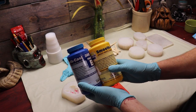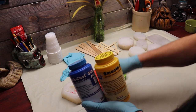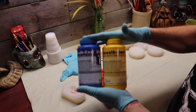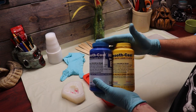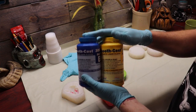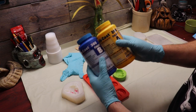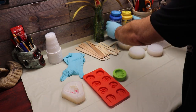I went to Amazon and we're going to use some Smooth-On products - I really like their stuff. We're going to start slow and build our way up. This right here is Smooth-Cast 305 - about $23-24 on Amazon. You can buy the trial kit to start. This stuff is basically two parts - you mix equal parts one-to-one, mix it in the cup and go. This particular one, the 305, is a white plastic, so whatever you put in the mold comes out white.